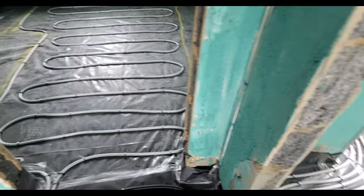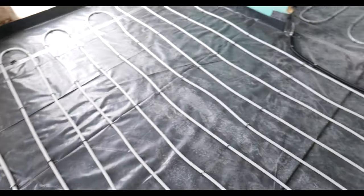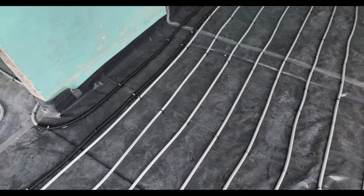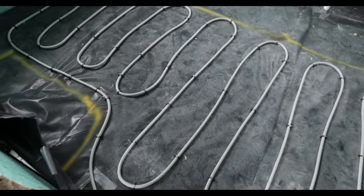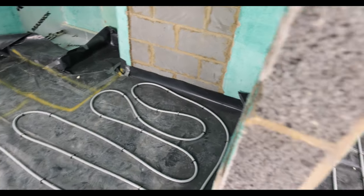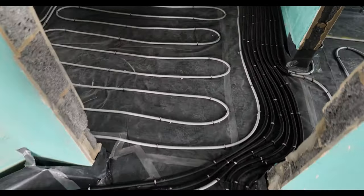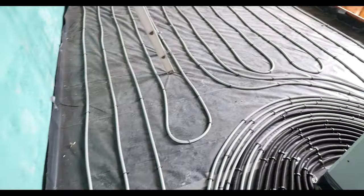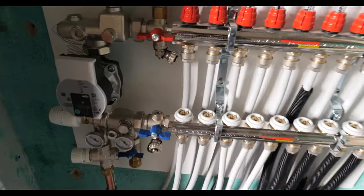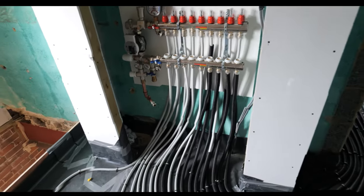All we did was use a staple gun — really simple and straightforward, no problems at all, 200mm centers. The Celotex here is not very deep and neither is the liquid screed, so we didn't have too much room to play with tracks or anything — that's why we stapled it, and it's also a lot simpler. The builders marked out in yellow where we couldn't put it. Whenever we install underfloor heating we always make sure it's full up before it gets screeded — it's filled up at just under 6 bar. When it comes to plastering we'll be able to just undo the screws, lean it forward, and get in there.